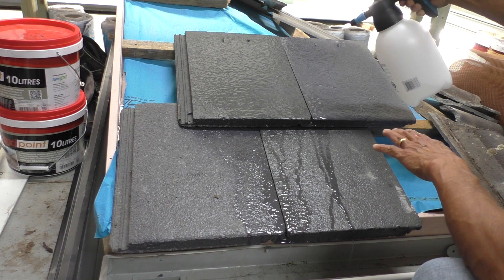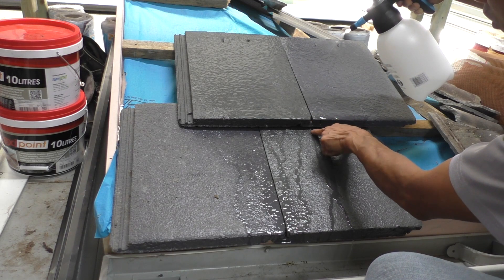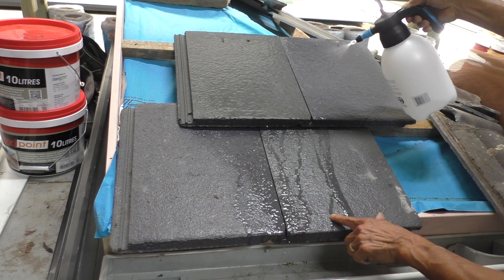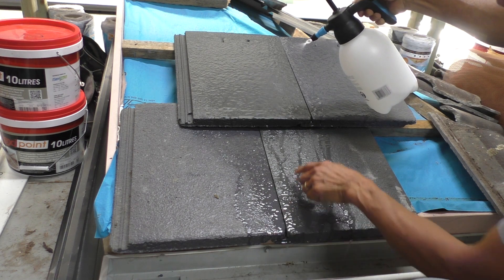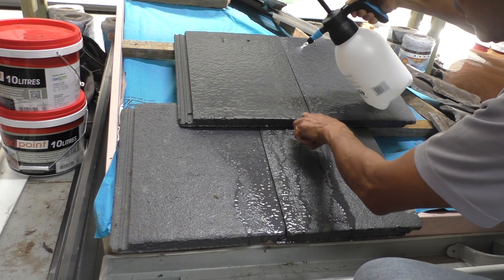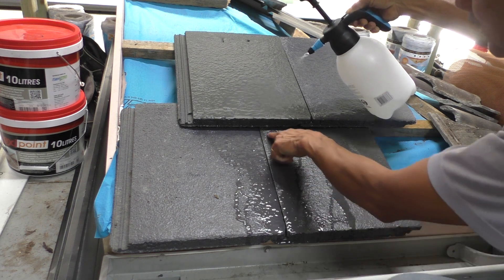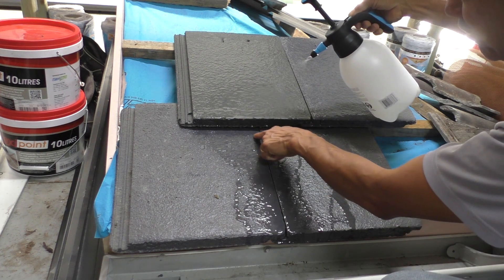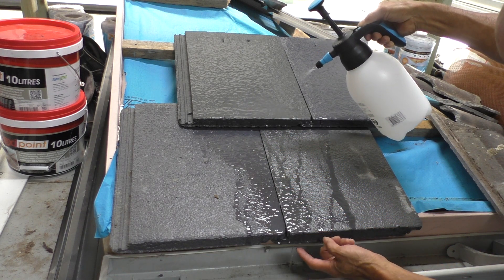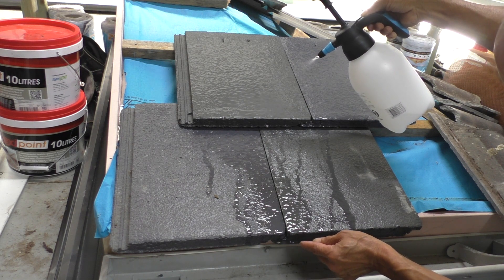In a cross pattern, water comes down the water course and runs along the flat tile, then it goes to the next course and runs across. You can see a concentration of water running down there — a lot of water gravitates towards the lap and you can see how much water is drilling down the water course.